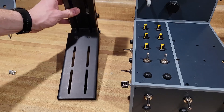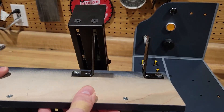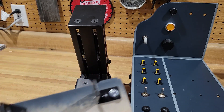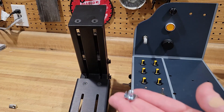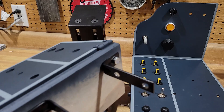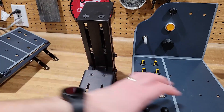The other cool thing is I'm going to be putting this panel on top. What I did here on the bottom is I got some of these brackets from Home Depot, took a hacksaw and cut it off, had to drill the holes a little bit bigger. Then I'm using some furniture T-nuts — they look like this — so I pre-drill the hole, bang them in there, and from underneath take your screw and put it in there, and this will slide and screw on the side.